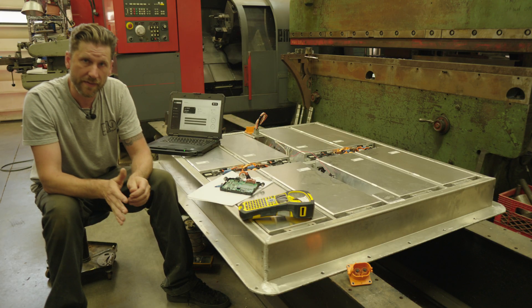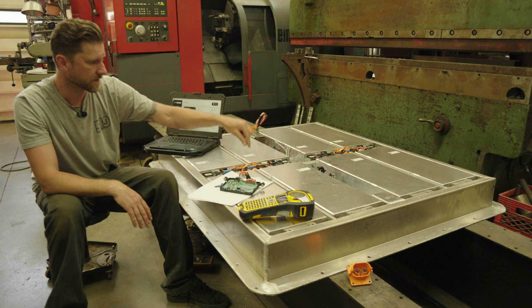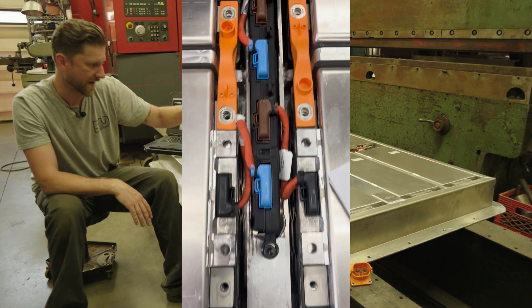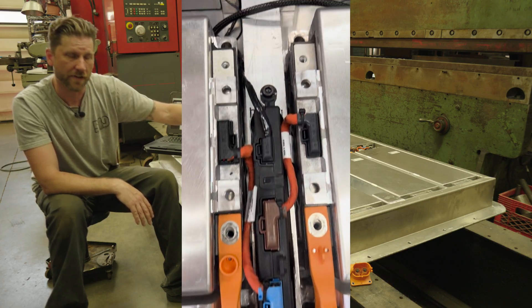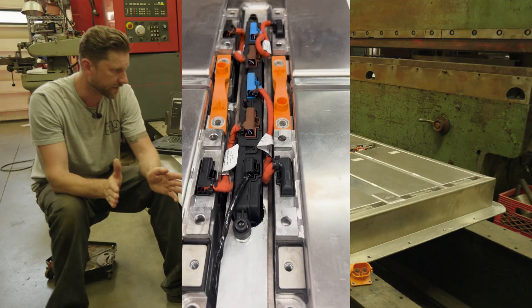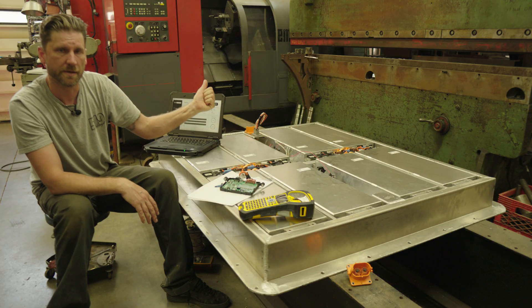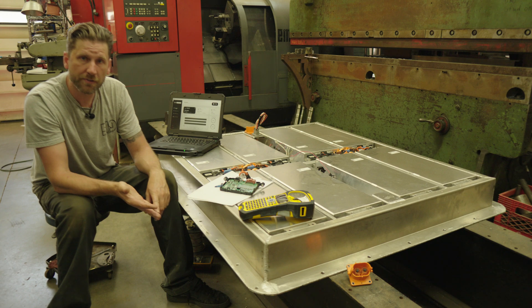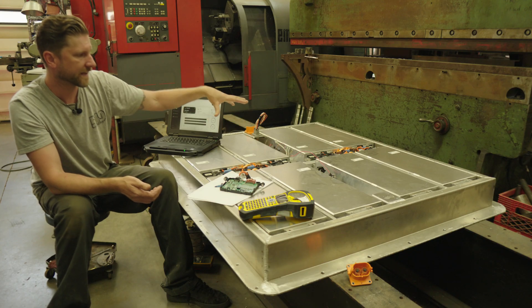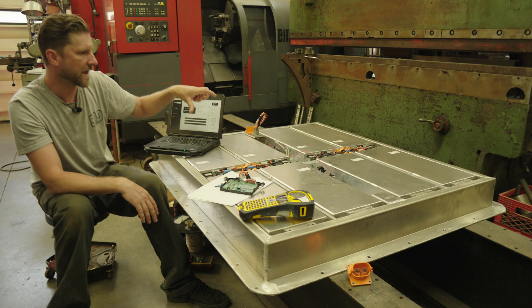One of the main reasons that's smart is that this is contained inside the battery pack. I'm using two of these large Volkswagen CMUs, and each one is responsible for four battery modules. They are chained together and CAN bus data is fed out of the battery pack. What's most beneficial is that to get data for all 96 cells requires only four wires coming out of the battery — 12 volt, ground, and two CAN bus wires — including eight temperature sensors.